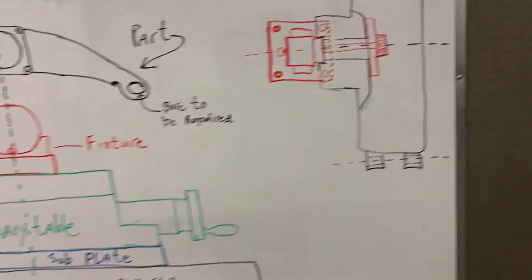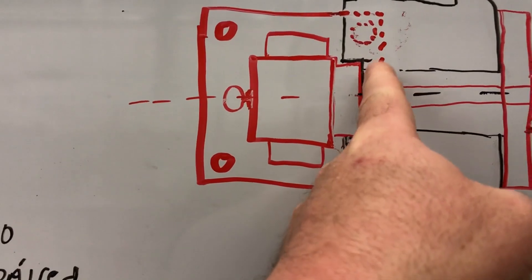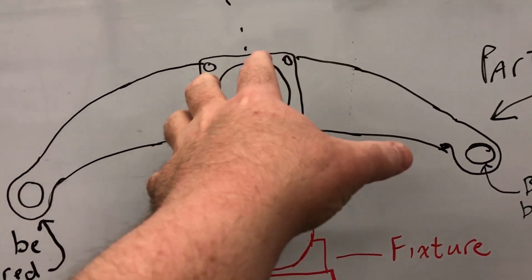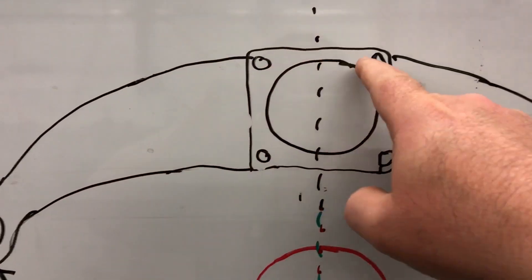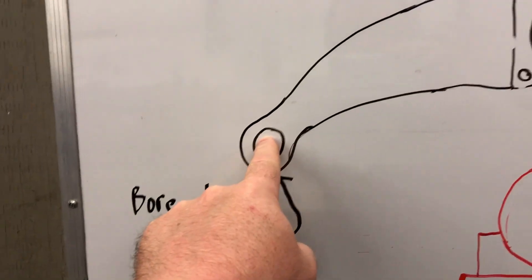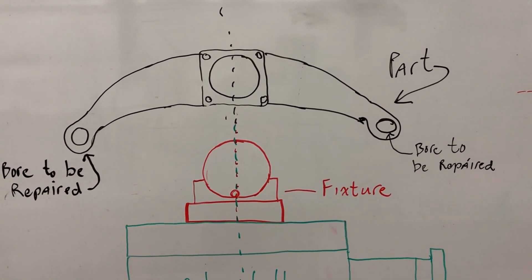The part mounted with a shoulder in the back against the face of the fixture, and then a bolt through with a bar strap clamp held it together. The part could still rotate around the bore axis during setup, so to correct for that I put bolts in and placed a parallel across them, then dialed the top of the parallel until the bolts were level. Since the original holes were all welded up anyway, I couldn't use them as a datum — so I went off the bolts, and my customer used the parts afterward without issue.